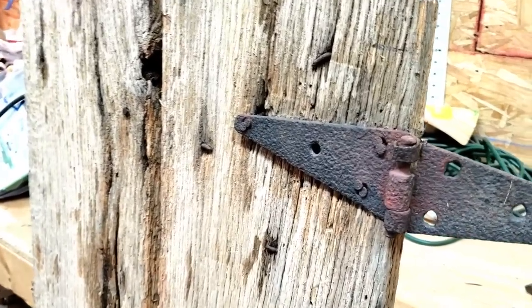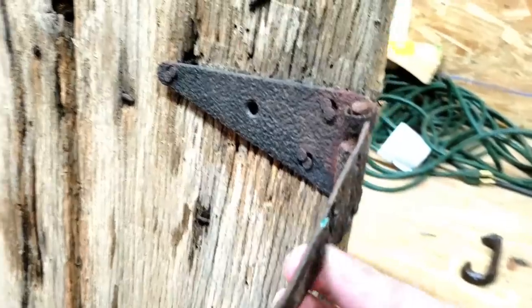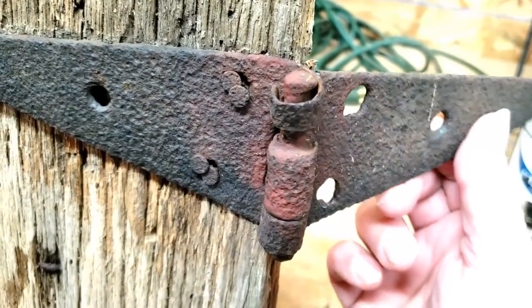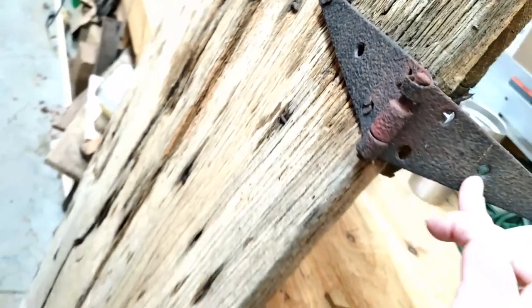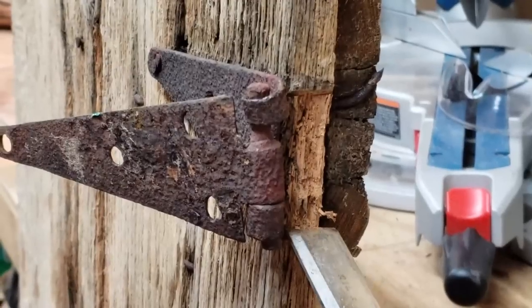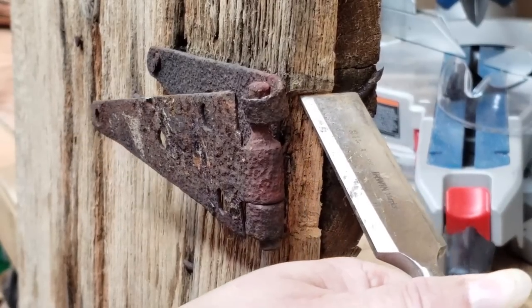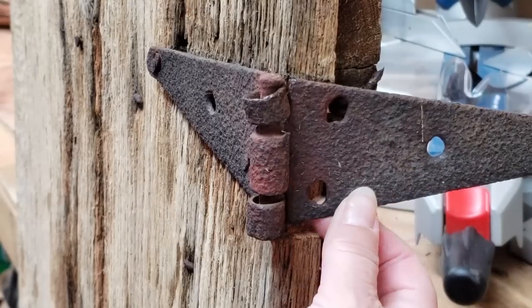The next thing — I loved the old original hinges. Look at all those old nails that are in there. I definitely wanted to keep them, and my idea was to leave them in. I wanted the hinge to lay flat, so it would be laying straight down. But to do that, I had to trim out some of the wood there so it would be able to lay flat, because you don't want anybody bumping their knee into it. So I basically just took a chisel. You can see how dry in some places that oak was, and then in other places, like in the other hinge, it was solid. It's very old, very worn, but yet it was a pretty solid piece of wood.